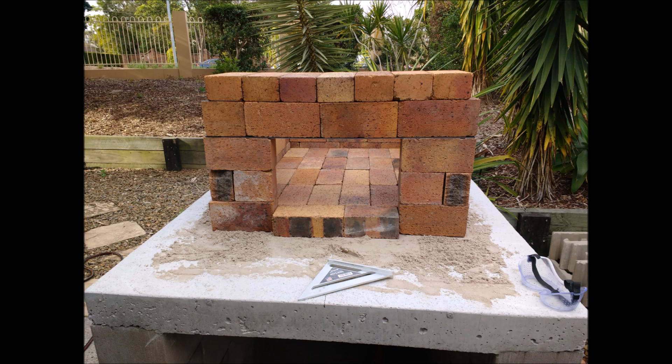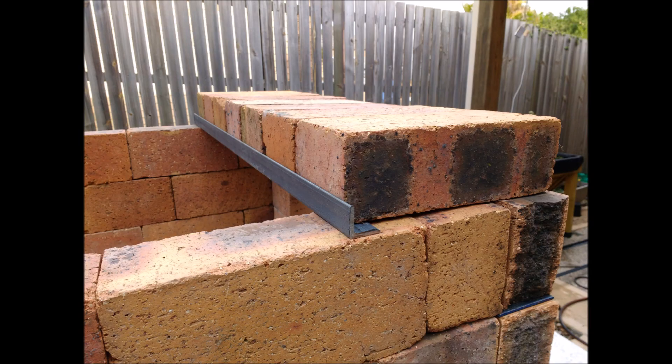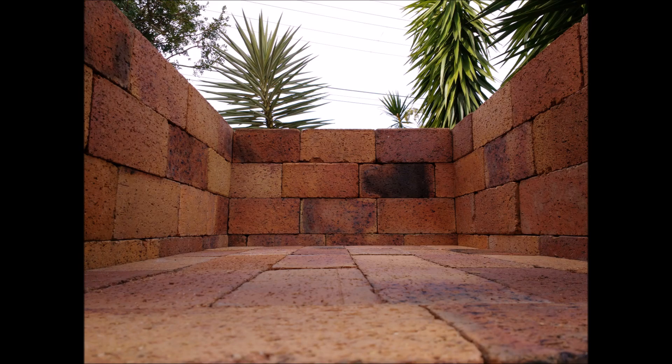You can see in these photos I've set the bricks out. I used a steel lintel to make the doorway, and I've also used — I think that's about three mil thick — steel equal angle bars, about three mil by 25 by 25. You use two of those for each beam, effectively, that goes across the top to form the roof. So these bricks are just sitting on top of each other, resting under gravity, with no mortar used.